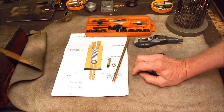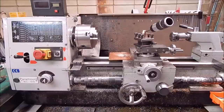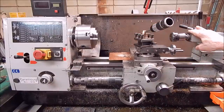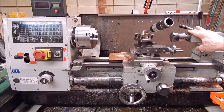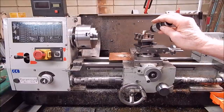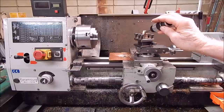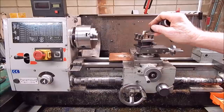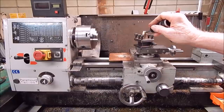Okay, let's get on with it. I'll do this on the Chinese lathe because I want to tap the thread using the tailstock, and my thread adapter fits in there pretty well. I'll give the Schaublin a rest, although I might use it for parting off as the collets are already set up. This will be an easy way to thread the outside of the 8mm rod.